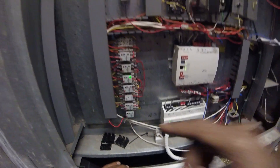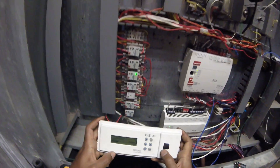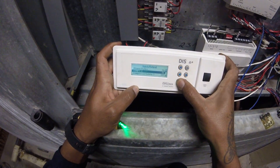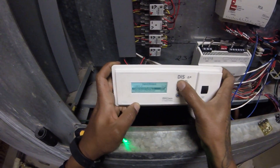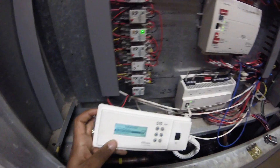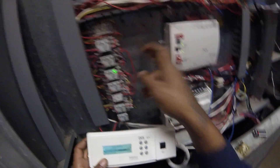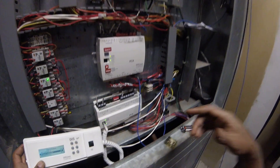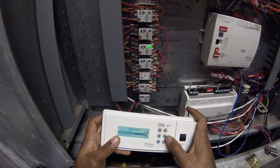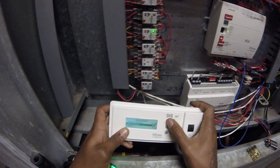I'm going to have to troubleshoot this unit. The problem I'm having is that the compressor is kicking in automatically. I think it's a control issue. I don't know if it's not pumping down because the solenoid is not lit up. The solenoid should be closed and it should pump down. You can even have a bad low pressure switch that is going into a vacuum and it's not shutting off, or it could be bypassed. I'm going to turn this blower on real quick.